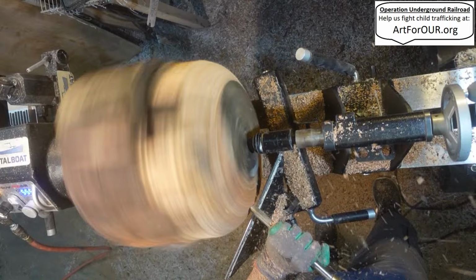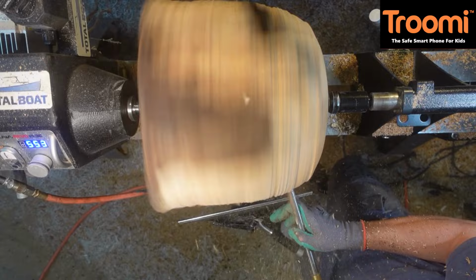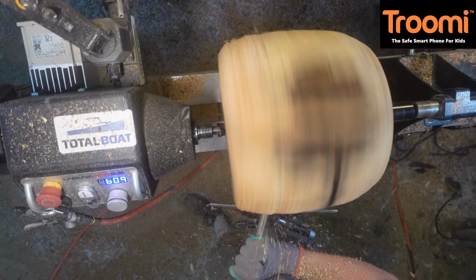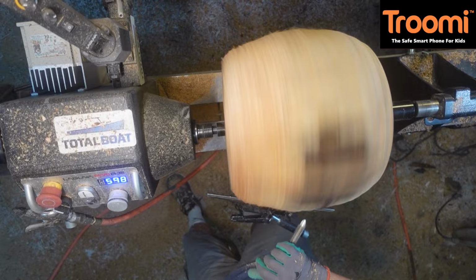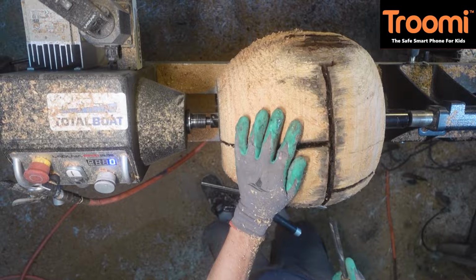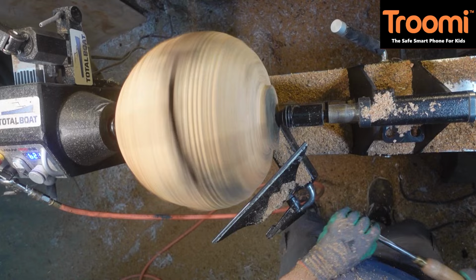So I thought I had figured out a way to cool off the resin without having to put it in a freezer and all this stuff, which many of you have kindly suggested. So my plan was, first of all, I put my air compressor in my basement of my house, which is nice and cool most of the time, and I ran my air hoses up through to my garage. The idea there was to circulate the air through the pressure pot as much as I could to still maintain the pressure and therefore drop the temperature of the resin. And on that last project, the Ember project, it worked like a charm.